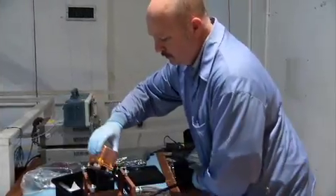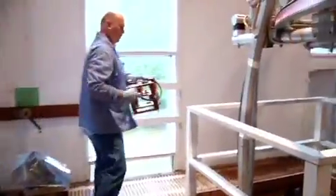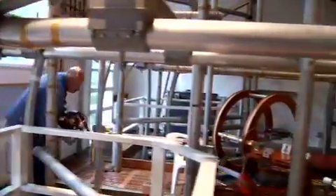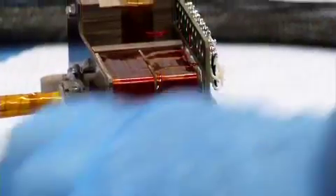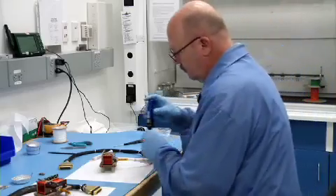The magnetometers, even though they're small, simple-looking instruments, there's actually a great deal of sophisticated electronics and testing and calibration that goes into building them. They're so sensitive that we ask everyone to use non-magnetic tools when they're working on them. Even if you had a tiny little fleck of metal that came off of a screwdriver, that would be enough to be noticeable and detected by the magnetometer.